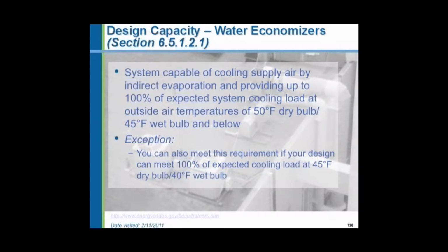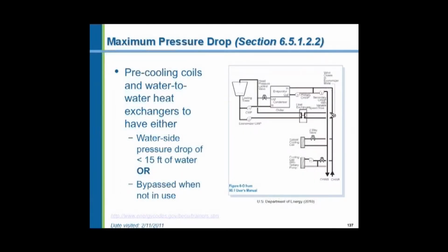So to make 55 degrees, you need 45-degree chilled water. And if you have air outside and you need 45-degree chilled water, that air has got to be about 35 degrees. So if it's cool enough outside and you still have a cooling load in the building, which might be a process of some kind or interior spaces, computer rooms, anything, it could be in a commercial building, use a water side economizer. Now the water in the condenser going up to the cooling towers is dirty.